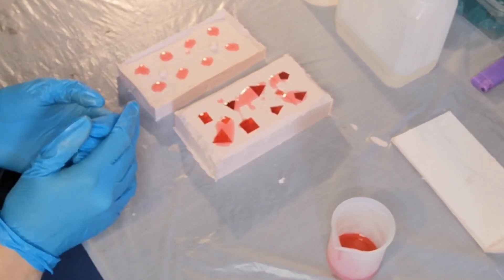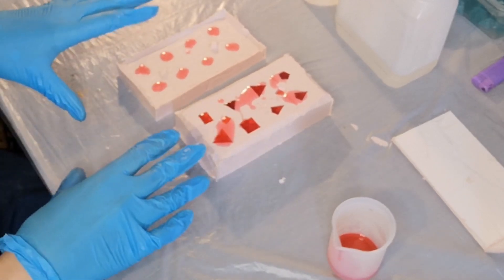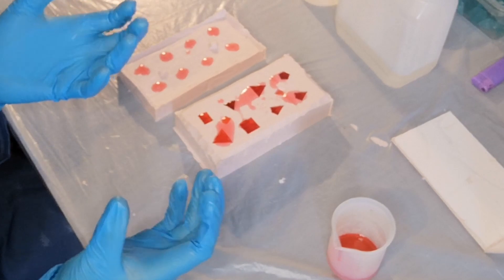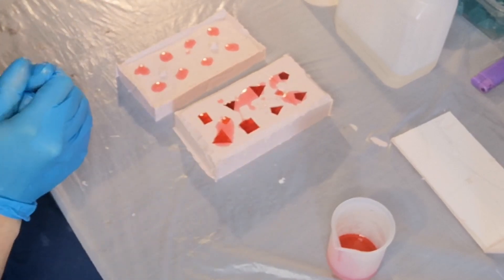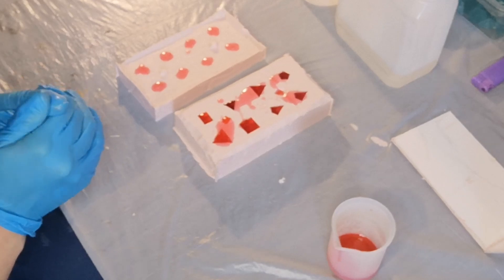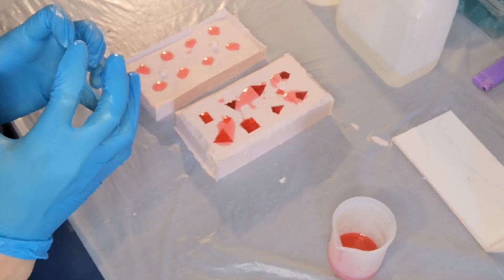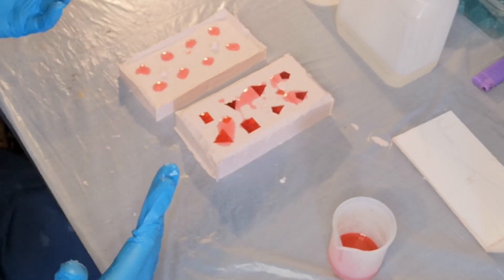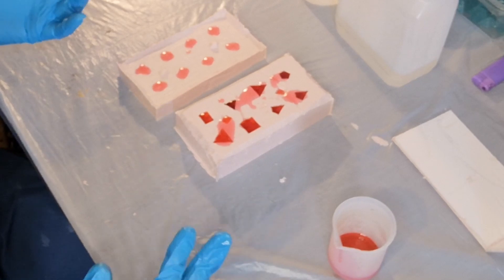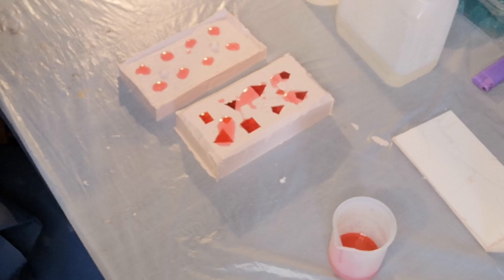It's good to learn about how your resin behaves — how much shrinkage it has, how much extra you need to put in. This one doesn't shrink very much at all — I think it's something like 0.2%, so that's okay. But equally, if you're going to put it in the pressure pot it's going to compress the material and you'll want a little bit extra. It's just learning that middle ground of knowing when you've got too much and when you've got too little.